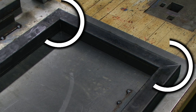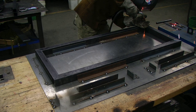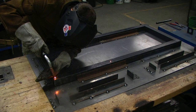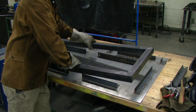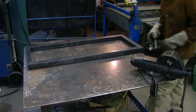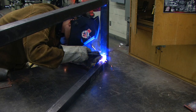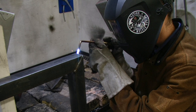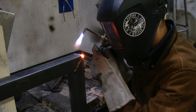If all of your pieces have been measured and cut correctly, all of the joints should fit up correctly as well. At this point, we are ready to tack up our seat frame. We're not going to install the lumber support brackets just yet — we're going to get everything welded on the outside of the frame and then add those later. Once tacked, we can move this over to our primary welding area. Our goal is to seal up the entire joint all the way around. We're going to be MIG welding the top, the bottom, and the inside edge. To seal up the outside edge, we're going to be using an oxyacetylene setup for better control on these thin outside edges. I do have some filler rod just in case I burn through.